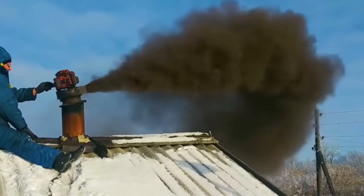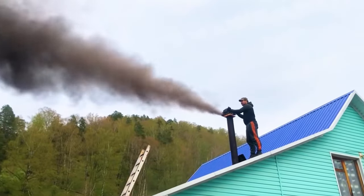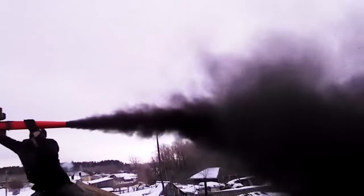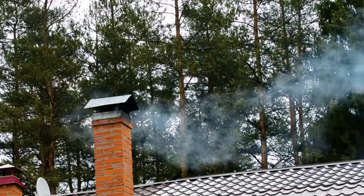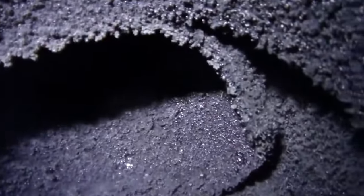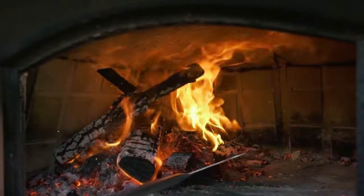The person in the video is not driving a train, but cleaning a chimney. This black soot is the remaining coal in the chimney. When burning coal, some of it will be introduced into the chimney through heat and stick to the surface. Over time, this will reduce the space inside the chimney, slowing down the air circulation, which will greatly affect the efficiency of the furnace.